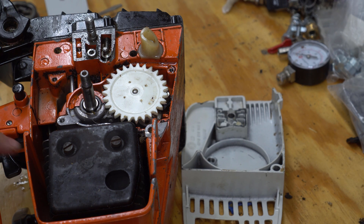When you're taking a Stihl 015 chainsaw and turning it from a 1/4 inch pitch to a 3/8 inch pitch, it's because the 1/4 inch pitch chains are getting pretty expensive. Not a lot of chainsaws use them anymore for regular homeowner use. All the new Stihl chainsaws use 3/8 inch, so it's easier and cheaper to find.